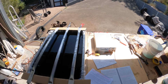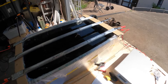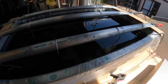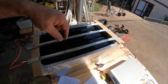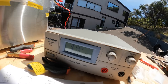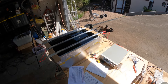We are commencing plating — we just started. 45 to 50 minutes basically. We've got the two parts in there. We've got 8 nickel anodes around, and the two parts in the middle, and we are running at about 1.7 amps. Let's see what happens — fingers crossed. I'll see you back here in 45 minutes.